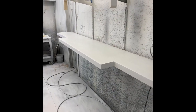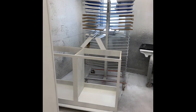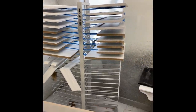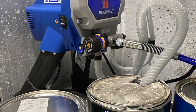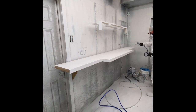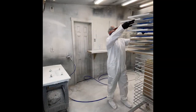Quick look in the paint room for this current built-in project. Got everything primed, it's all been sanded and cleaned up, anything that needed caulk has been caulked. We're going to start with the top coat. A shot of our primer and our paint of choice for most of our projects — we've got a full video on our paint setup as well. Here we've got a few different time-lapse videos of me in the paint room spraying cabinets, spraying the parts. So after we've sprayed our primer, sanded everything, and prepped everything, we'll spray two top coats, sometimes a third if need be.